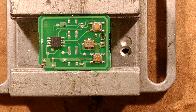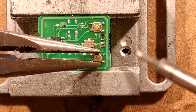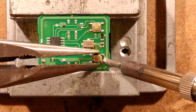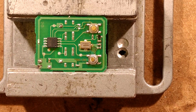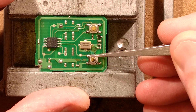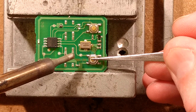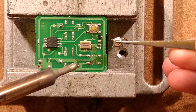Now I've done that, I'm going to grip the switch and try effectively hinging it up while alternating the solder between the two solder joints at this side, which will hopefully release it. So I'm going to start alternating now while hinging it. It's lifting up — make sure it is completely up so there's no solder bridges under there. I'm going to grip this with the tweezers and just gently desolder the other sides, and again you may have to alternate between the two of them — and that's it off.